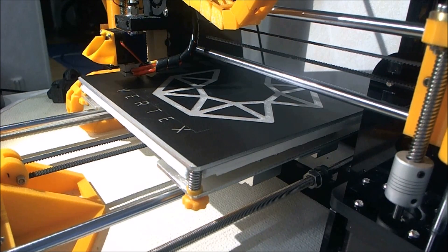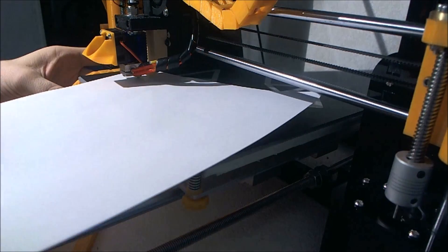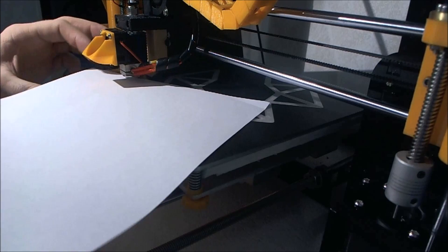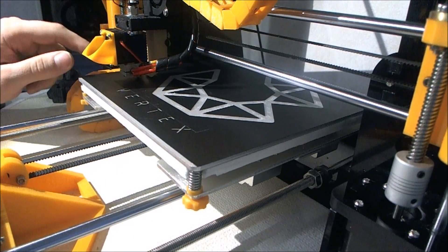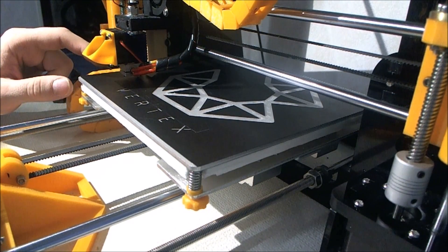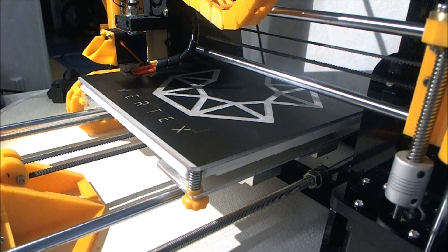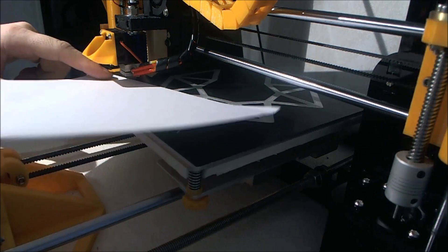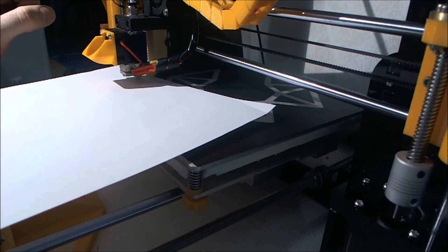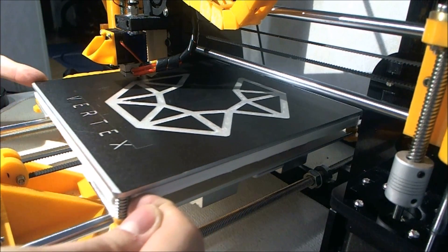Put the paper under the nozzle, then take the screwdriver and adjust the screw. What I like about having the fan running is that it's noisy — so if the nozzle touches the bed, the sound changes and I can hear and feel the difference. It will start to vibrate, so having the fan on is actually helpful so you can hear when contact happens. Once you place the A4 paper, listen for the sound difference — that's how you know it's right. Both sides should feel the same.